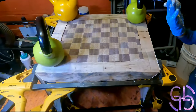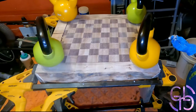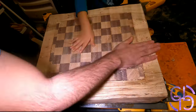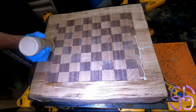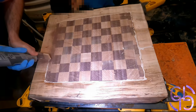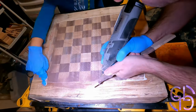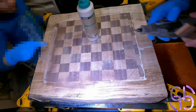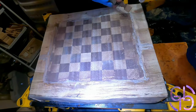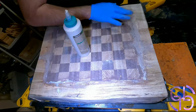Lesson is: let your kids experiment and listen to them. Their non-corrupted brains can think outside of the box. Now it was time to seal up the cracks and gaps — and oh boy, they were absolutely horrible, especially the crack on the ends. It was huge and we could stuff a lot of wood shavings in there. We took them from the dust bag from the saw and kept putting them in until it was full. Then we poured glue into every single opening and kept pouring until no more would go in. Following that I took out the Dremel and proceeded to generate fine sawdust around the cracks, and my son mixed the glue with sawdust, creating a very fine paste to make sure that every single crack was fully closed. We let the whole thing rest for 3 days.